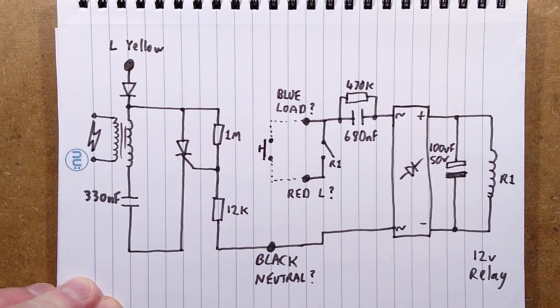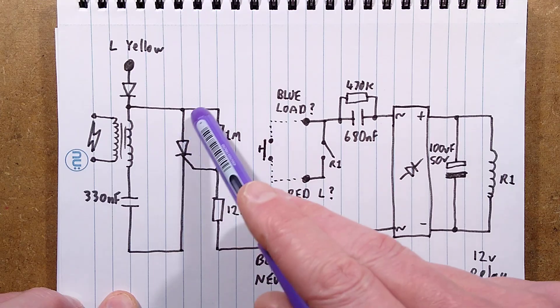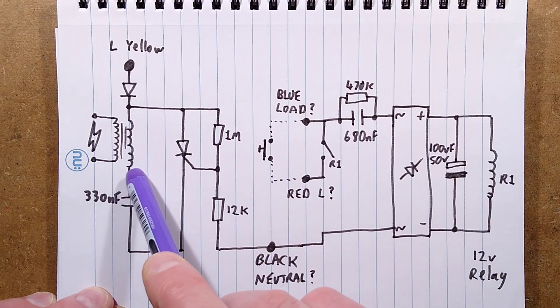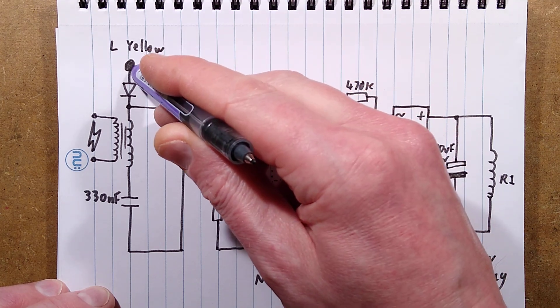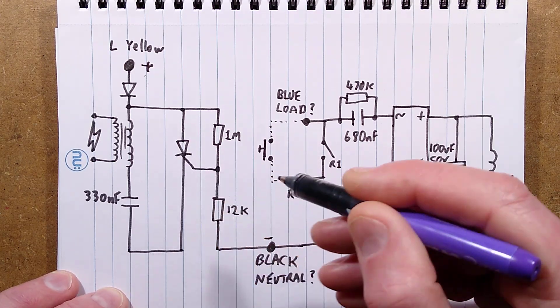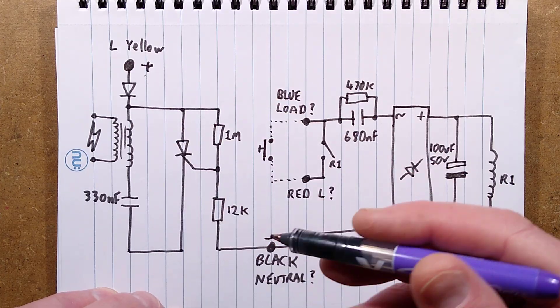The high-voltage circuitry is very odd. I'm using UK and Chinese terminology — making black neutral and guessing yellow is the live. The way the circuitry operates is extremely odd because normally you'd expect the neutral to be in a certain position, but there doesn't look to be continuity of the circuitry, and this had me puzzling for a while. The capacitor charges up via the inductor when live is positive, charging via this diode until no more charge can go on it. The current path it finds back is actually via the thyristor — but there is no official current route through a thyristor for the positive to find its way back by conventional current flow.